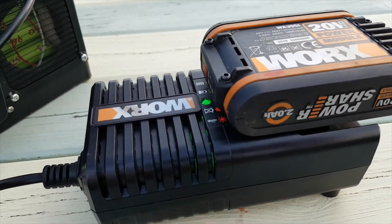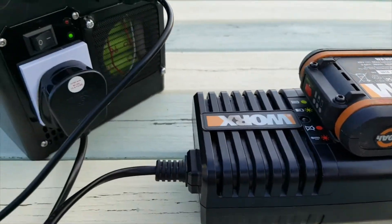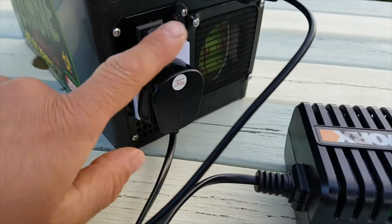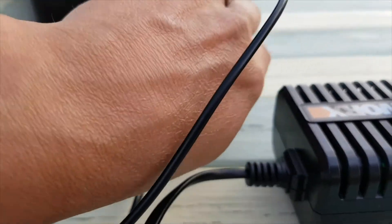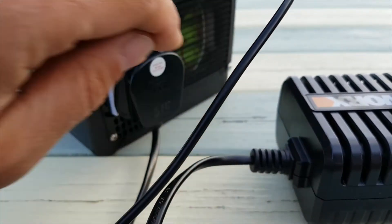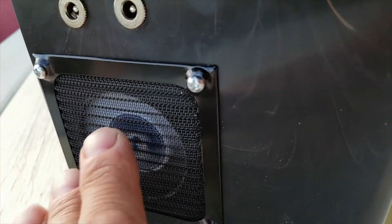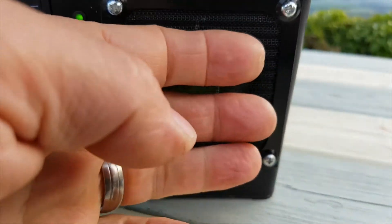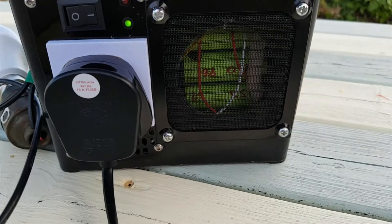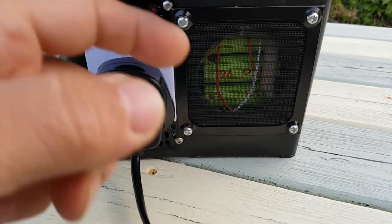It's not charging at 5 amps — it's actually charging at about 2 amps, but it's certainly charging. The cooling fans: this one has its own fan which draws in through the vents at the bottom and blows into the case, venting around the cells. The fan on the other end draws air in and passes it right through the cell matrix — you can actually see the cells in there. The way I've designed it, the cells are force-fed air, the inverter is also force-fed air, and they both exit through this point here.